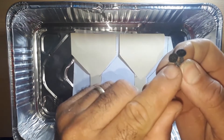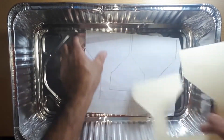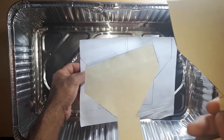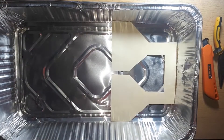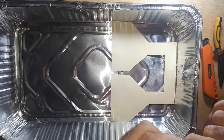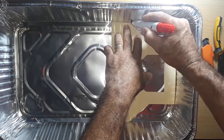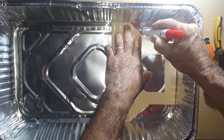Additional materials include two lag bolts, a template with the drawing of the dipole — you can download it at jmactualidades.com — and a cutout of half-inch PVC pipe. For the important steps to make the antenna, we will take the aluminum container, place the template, use a marker to trace, and then use a knife and scissors to cut the drawing made on the aluminum container.